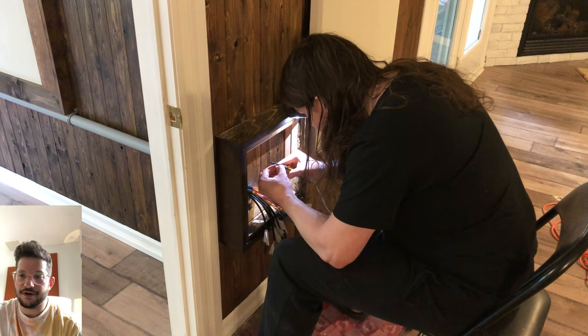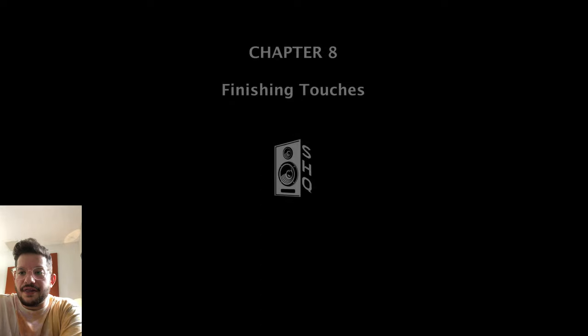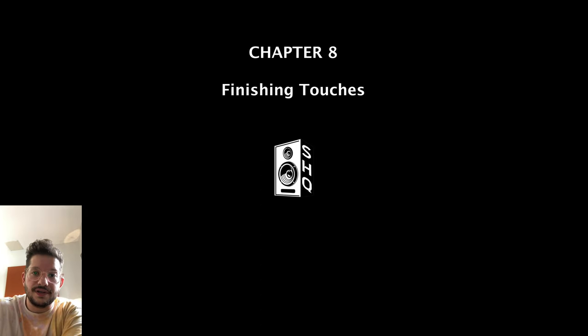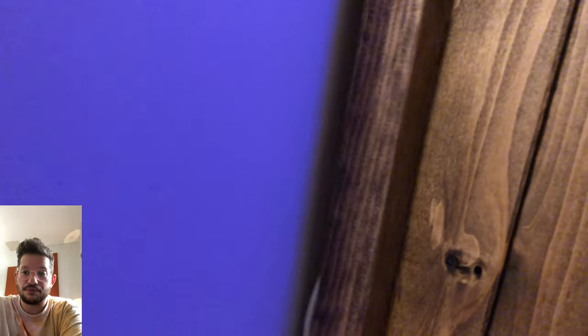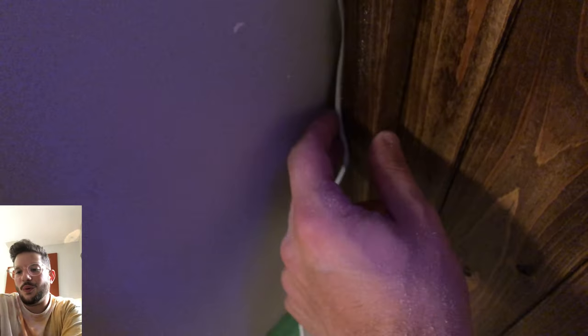The conduit comes out right underneath the front window so we can mount all the wiring into the rear of the client's desk. Here is the very final chapter — all the little finishing touches. I cut a 45-degree angle on this piece of wood trim that butts up against the wall to hide the wiring. I did a little notch for the controller of the LED lights, and that 45-degree cut meets nicely up against the wall. These are all the small final detail touches that really provide our client with a nice finished product. Our clients don't want any wires hanging out looking unprofessional — we do not want any of this to look DIY.